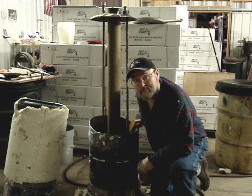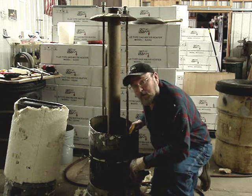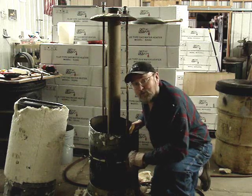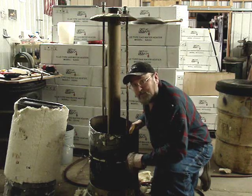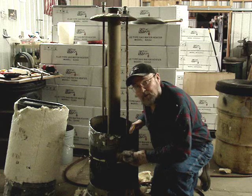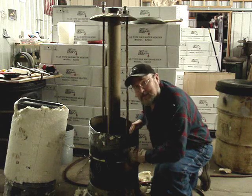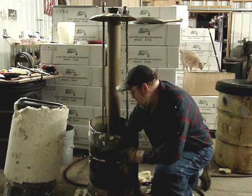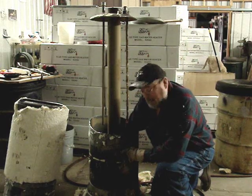I'm surprised — there's not really much sediment in this heater. It's 15 years old, on a small town water supply. However, this is the reason that all tankless water heater manufacturers insist upon the water being filtered and/or softened before it enters the heater. Because tankless water heaters don't have a tank, they have no surface area internally to store deposits of sediment and iron and those things that are in untreated water.